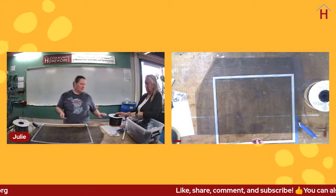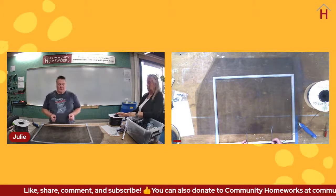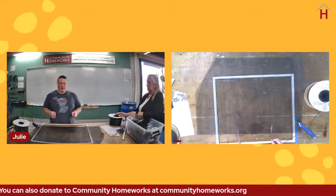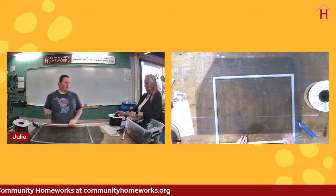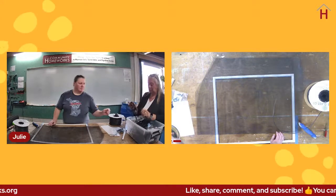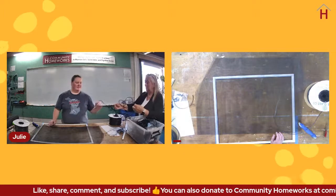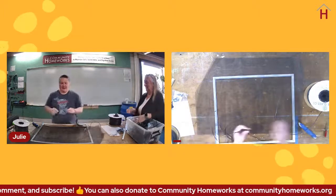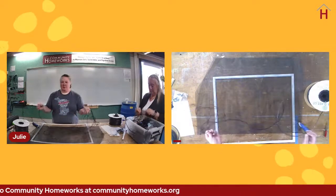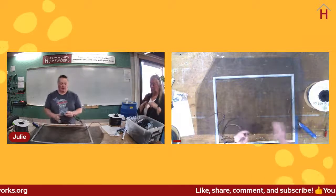I do want to mention one other thing, one other plug for going to the smaller stores that sell it in bulk. I don't know what Midtown Ace has on hand, but I know that Gales True Value has what we call foam spline, which is different than rubber spline, which is most likely what you're going to end up with if you buy one of those packages. You'll get a rubber spline, and there's nothing wrong with rubber spline. It's just a little bit less user friendly, in my opinion. The foam spline is a lot easier for the average person to work with.